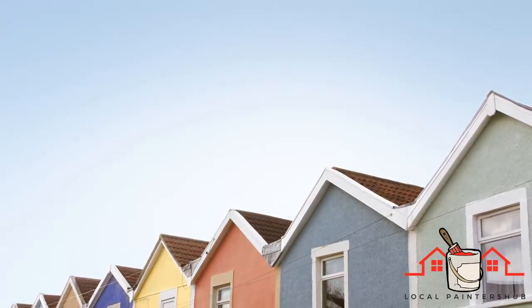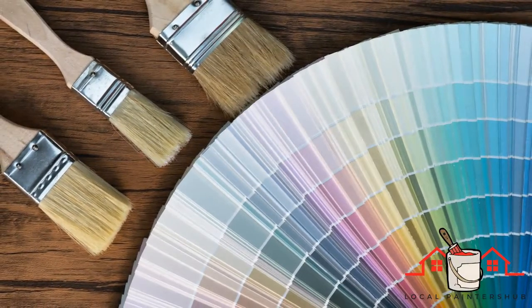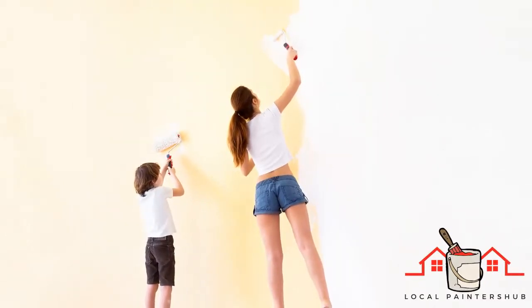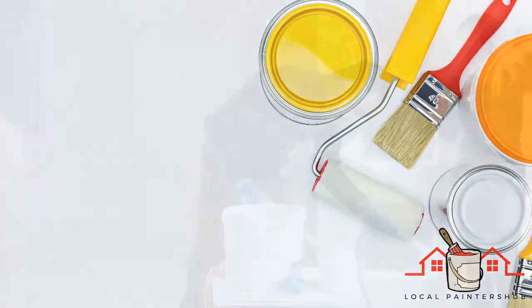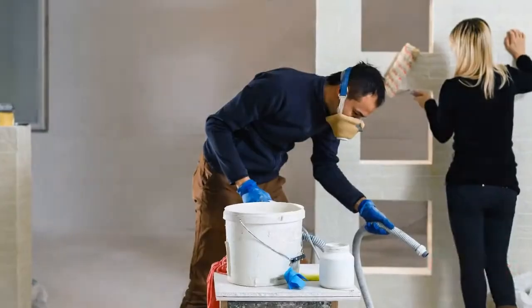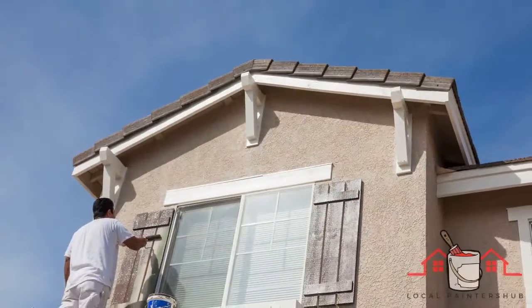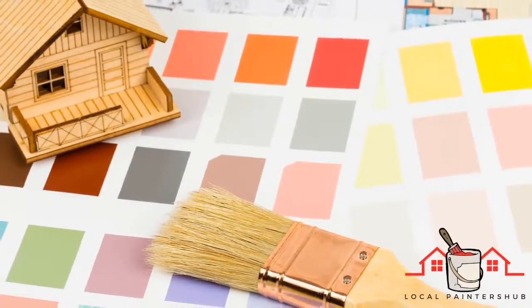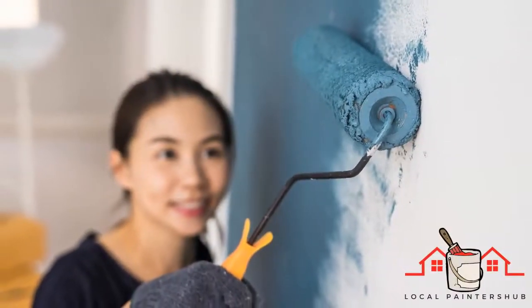A good tip is to always begin at one far end of the corner, running your paintbrush strokes not top to down across the room, rather roll from the bottom up, and always aim for smooth steady strokes, making sure that your roller is well covered and evenly painted. Never tackle multiple walls in tandem, instead always paint one wall at a time and work your way around the room. If your paint job needs multiple coats of paint, leave the paint to dry overnight and apply the second coat if necessary when the paint is completely dry. When removing strips of decorator's tape, always take off the strips slowly to avoid chipping the paint, and that is really how you paint an interior wall, and I think if you do the wall just so, then you will agree that following these simple steps can completely transform the room.